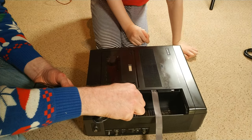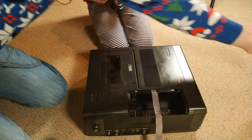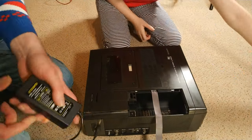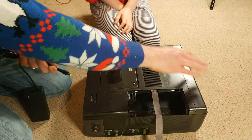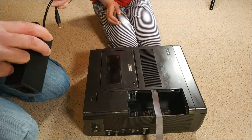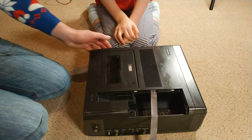The barrel jack fits, so maybe we might be able to cheat and just give it a test. What I'm hoping to do is get the proper main supply sorted eventually. One connector pin will be earth — the metal inside of the machine is all at earth — so we can work out which pin is earth and the other should be positive 12 volts. That's a good start. We've also got the RF out, so you can plug this into an old TV.